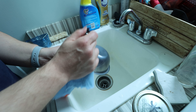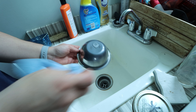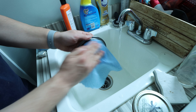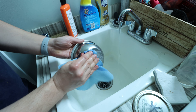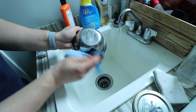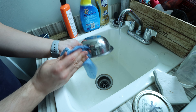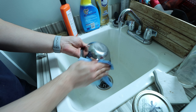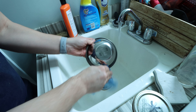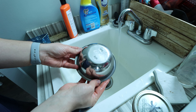Washing it off. A dry lubricant wouldn't be very useful in industrial applications if it just flaked off easily from the surface you sprayed it on, so it does have some sticking power. If you rub with something moderately abrasive like a paper towel for long enough while running it under water, it will eventually come off. But I've discovered that pumice hand cleaner — the same stuff you use to get paint off your hands — works great, as the tiny abrasive pumice particles very gently scrape it off the surface. You don't need to apply a ton of force; just gently massage it in with your fingers or a paper towel and then rinse away. And voilà — a nice dark etch.